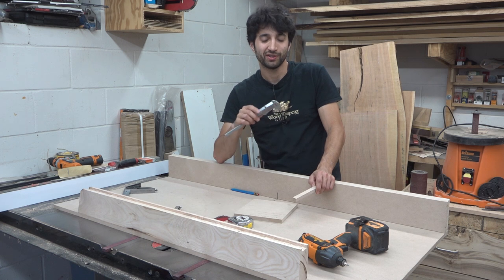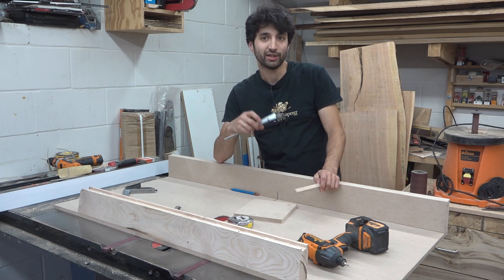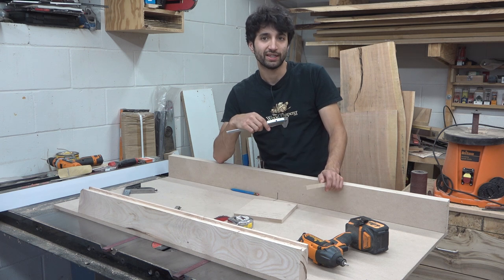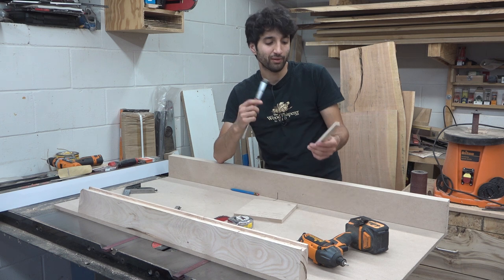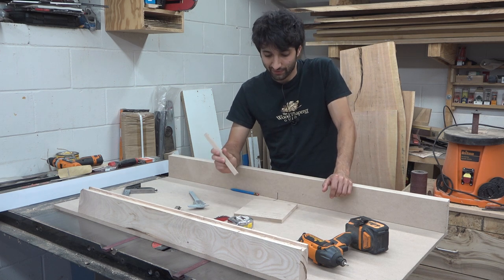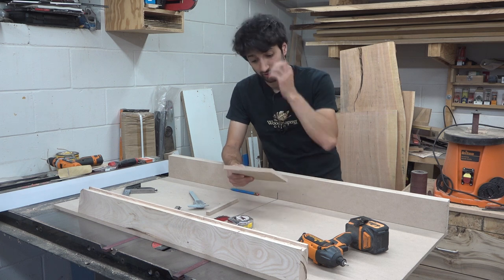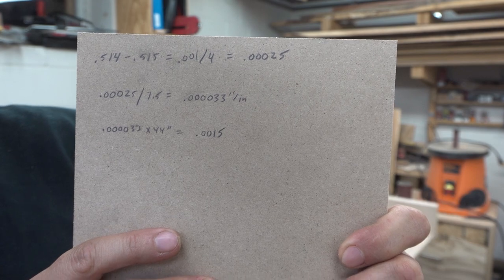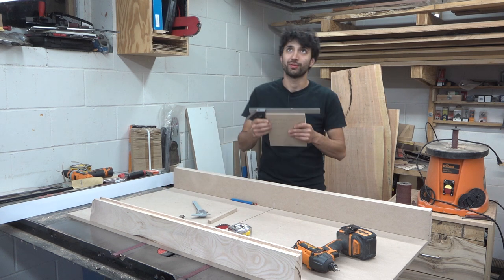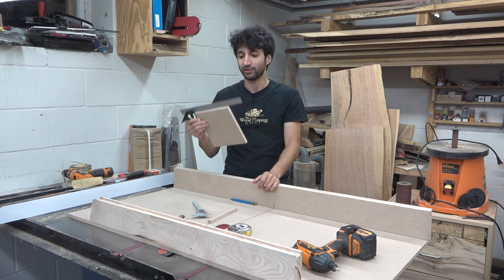That one adjustment pretty much nailed it, at least as far as my caliper can determine. The difference from top to bottom is off by a thou, which is pretty good. The caliper gives a slightly different reading each time I move it, but the difference between top and bottom stayed consistently a thou, so I'm guessing it's fairly accurate. With this deviation over seven and a half inches, my total deviation is .000033 inches per inch — so over a 12-inch length, my deviation from square should be less than a thou. For me and the stuff I do, as long as I can hold a square to it and see no light showing under the rule, that is good enough for me. I'm totally happy with this — as far as I'm concerned, this thing is perfect.